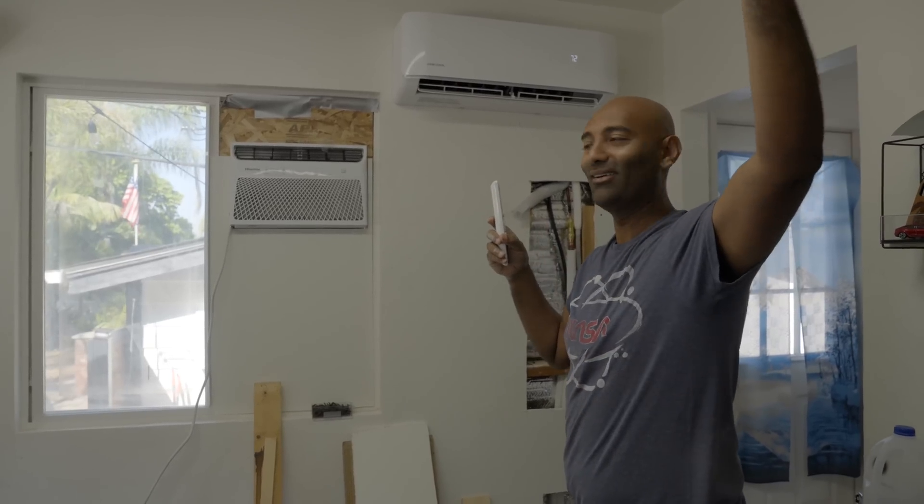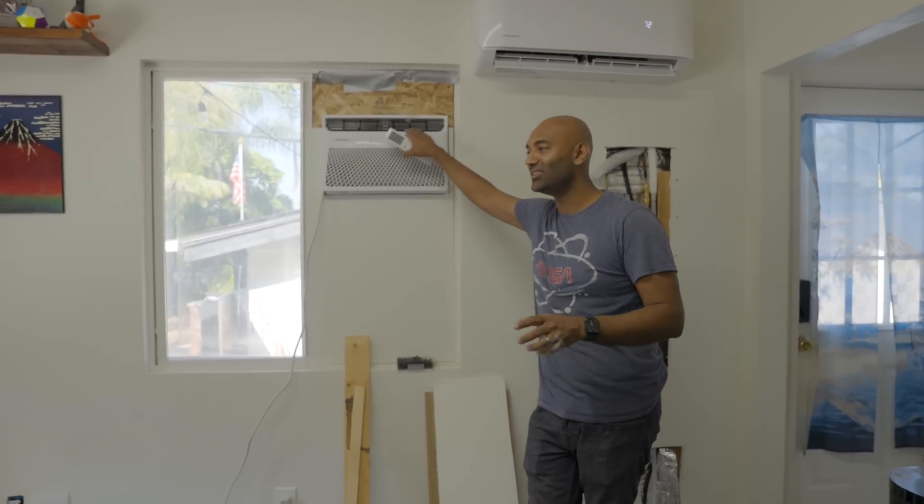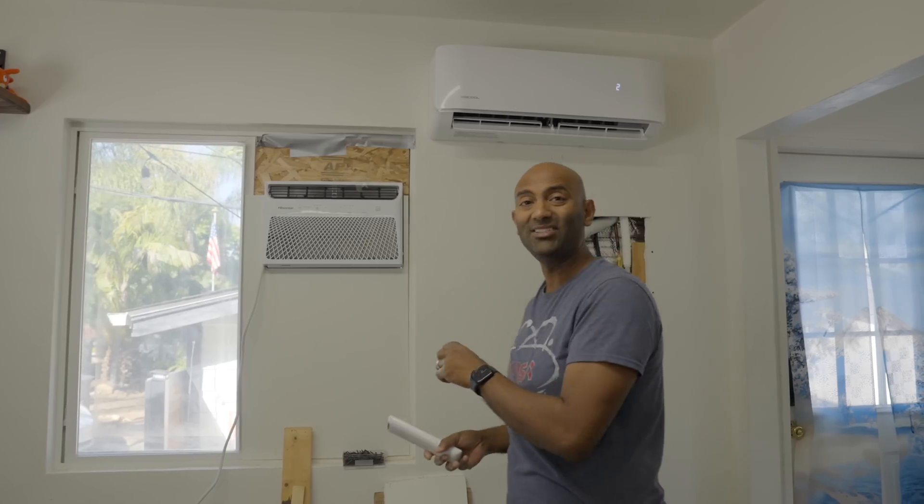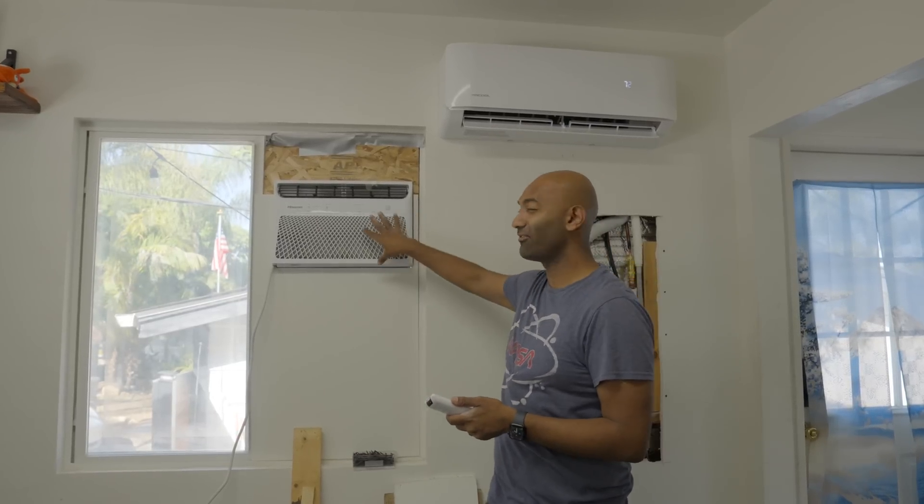Inside, I can feel the air all around — and here's the crazy part: no vibration. Even in turbo mode, the ambient noise is minimal. This is a heat pump — heating and cooling. In winter, you just switch to heat mode: the pump reverses, hot air comes out here and cold air goes out there. So this replaces both the window AC and the resistive heaters. It also has a SEER rating of 22, compared to around 14 for the window AC.